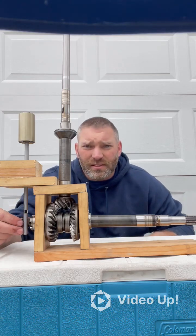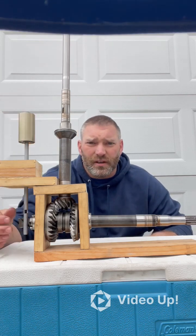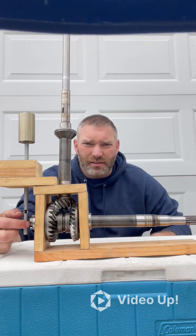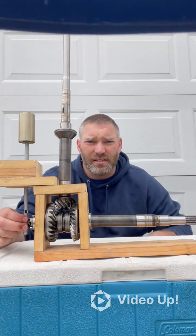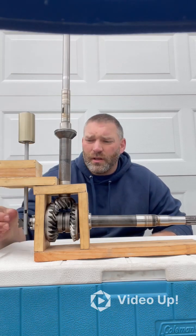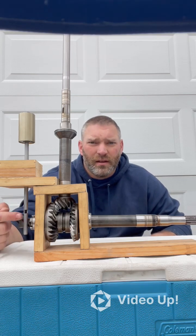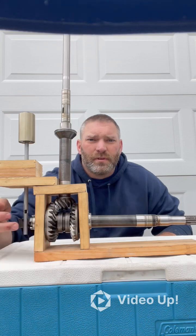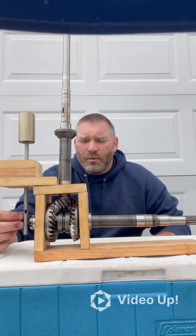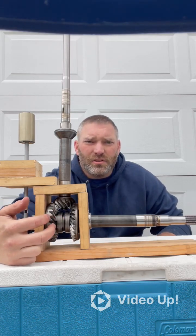This dog gear slips backwards and forwards and will shift your boat into forward and reverse. The way that works is that this piece goes in and out, and this is connected to your shifting rod. There's a diagonal cut in this rod, and then there's a slice in the actual shifting rod that sits into that diagonal. When you pull your shifting rod up, it'll push this rod in and that will engage your dog clutch with your reverse gear. And then if you push this rod down, it will cause this to go forward and it'll pull your dog clutch engaging into your forward gear.